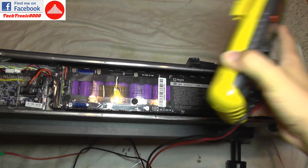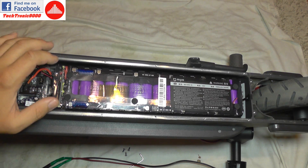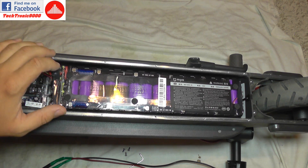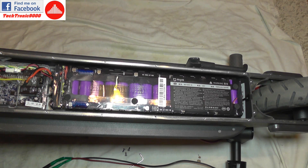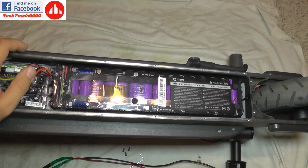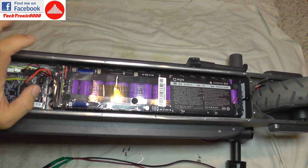This means the battery is not outputting its voltage because the battery is smart and well made. There are only a few issues that can disable it. Knowing that I was going fast over bumps, this may indicate a physical defect or something burned out — but I was just driving normally over bumpy roads. My guess is a contact issue somewhere. This battery may also have a problem with the fuse that burns out, so I'm going to investigate whether it's the fuse or something else.